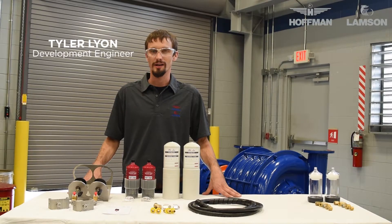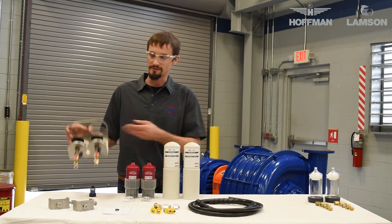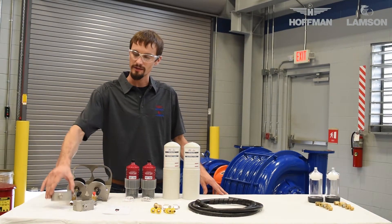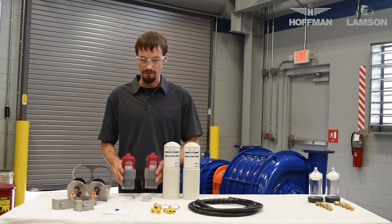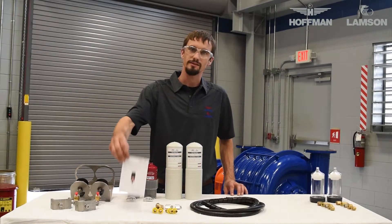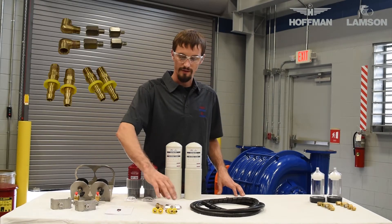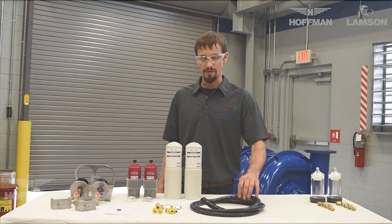This is the contents of the auto lubrication package. Here we have the heavy-duty bracket with all the fittings installed already, heavy-duty seat clamps for attaching it to your base frame, two auto lubricators fully charged with grease and battery packs for them both, an installation and operation manual, heavy-duty covers, various fittings, rubber hose, and spiral hose protection.